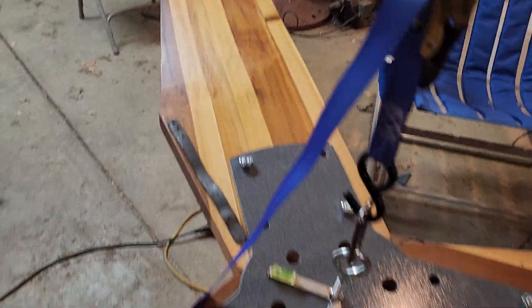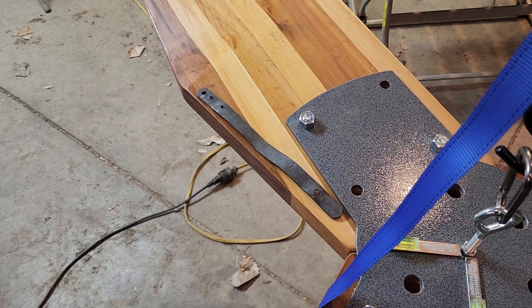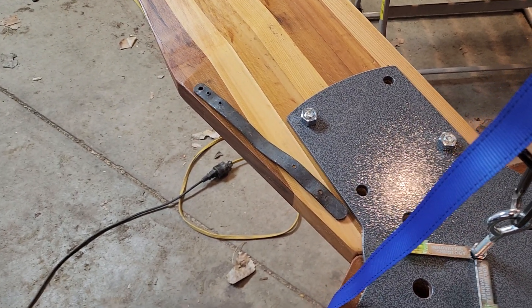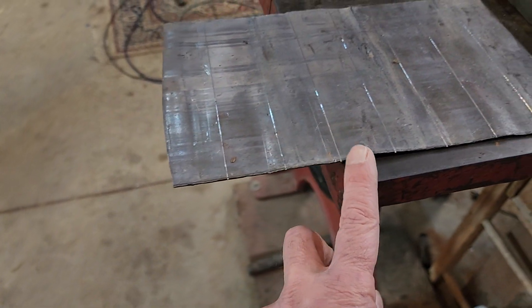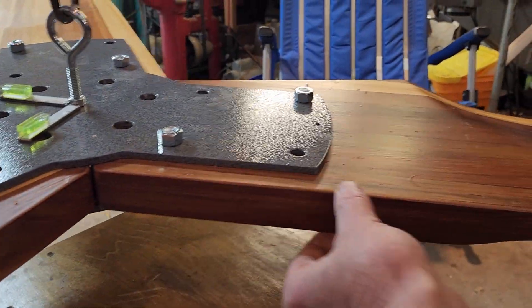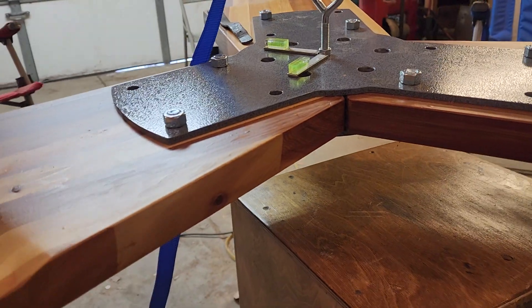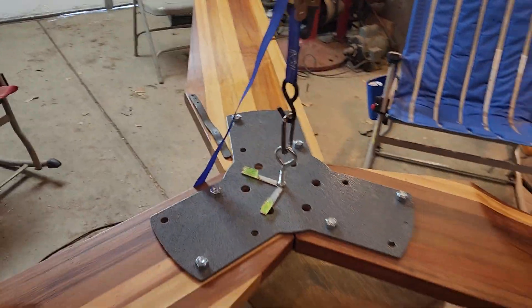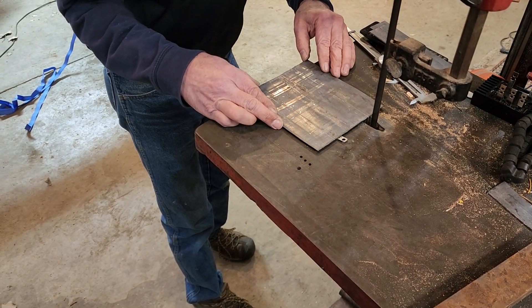I like to add weight near the hub, near the root of the blade, not out where we've carved. This is a decoy weight — it's made of lead, for holding decoy ducks down during duck hunting. I also have some lead sheet that I've cut to exactly an inch and a half wide — I can cut it on the band saw no problem. It fits nicely on the edge of the blade in here, and this is my preferred place to add weight. Wood screws will go right through the lead, so I'm going to cut this lead sheet and balance the blade.